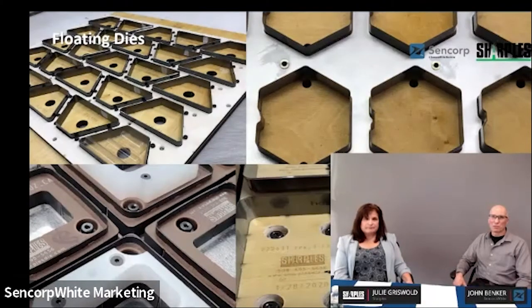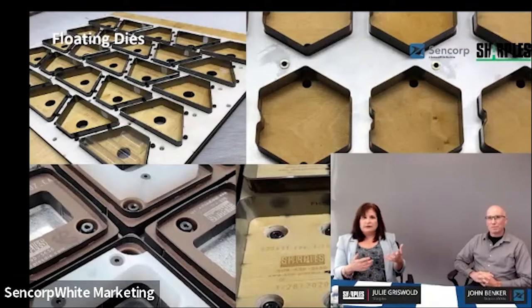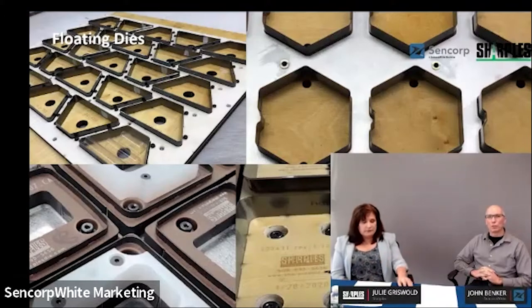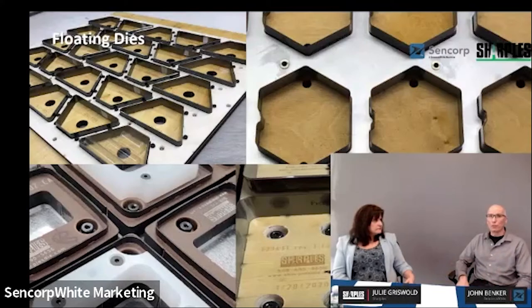Going back to that customer—it ran fine the first time with a blended radius, but over time buildup of material at the joint failed when they switched to a thicker material. What happens is the buildup of material gets in that joint at the tight radius, and that tiny seam will actually pull apart the joint. So common knife: avoid it if you can. In the long run it's probably not profitable if you're going to struggle with it. We like the half-inch recommendation between knives as a comfortable area for support. We get pushed to quarter inch, but even at that it's harder to control shrinkage.